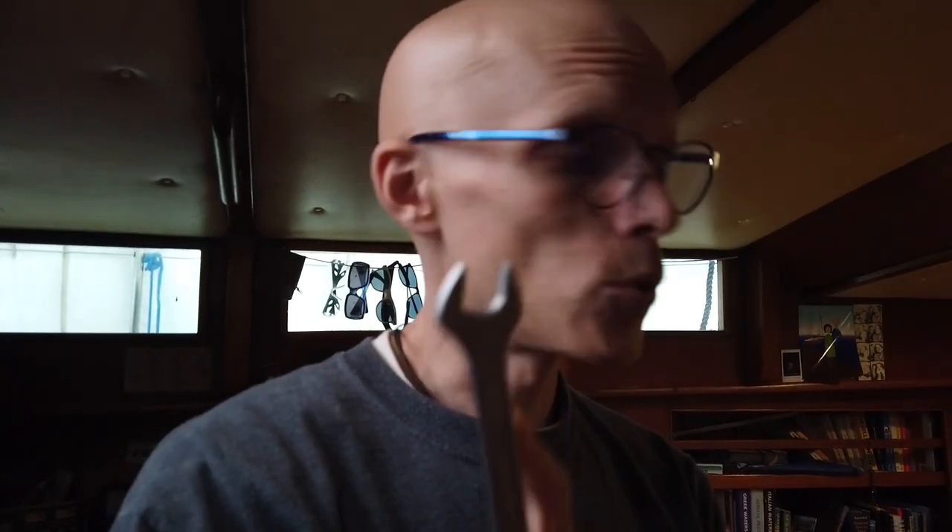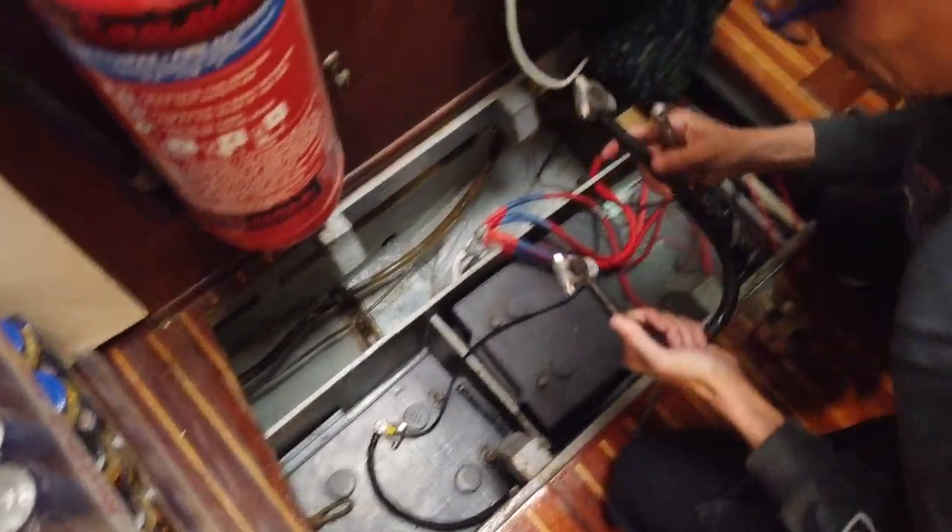Here's something interesting to keep in mind. When you disconnect your batteries, make sure that all the other power sources are gone as well. I was thinking about the shore power, I was thinking about the batteries, I disconnected both, and the lights were still on — it really messed with my head. I started disconnecting the engine starting battery, and only then I realized: we have solar panels. So we are under a roof right now, but they are still working.